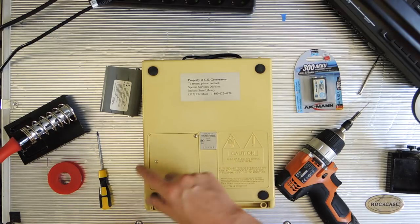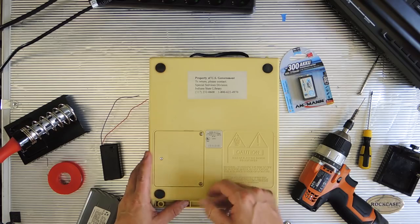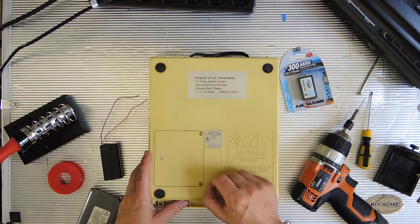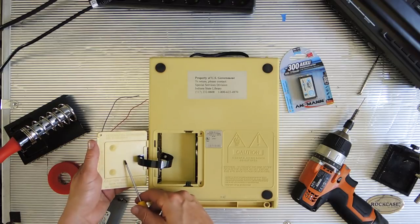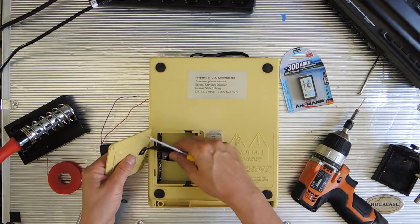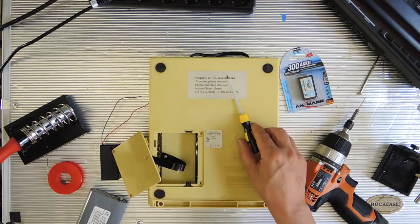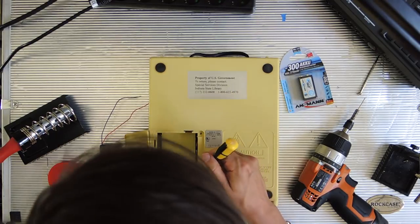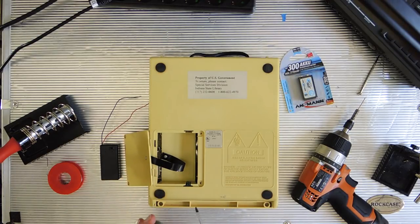So what I'm going to do is attach this 9-volt battery case to the player, probably on the side, so I can easily exchange it, and run it off this rechargeable battery. Let's see how long that lasts. So let's open this up and solder the 9-volt battery block to this. As you can see, they never wanted anybody to lose this thing, so they've got a really strong piece of plastic here to hold this. Now, there's corrosion here, and there's even more corrosion here. The battery pack definitely leaked at some point, but I think these contacts will still be usable.